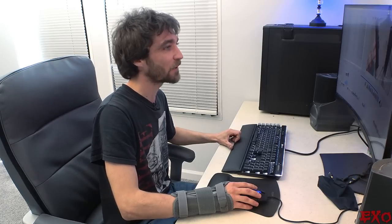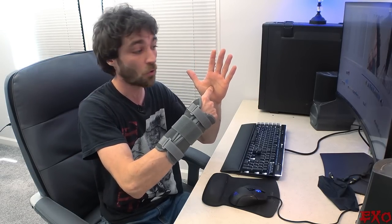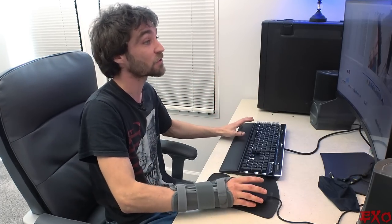I want big time accuracy when mounting these bad boys. My port width depends on it, so there's no pulling any punches. Made sure to use the existing frame line of the steel cage to extend out as a guide marker. This is exactly where I need to be. So I do this little trick to avoid things dancing around on me. Small little screws to keep the centers aligned. That's the biggest bugger. If you're not directly centered in the hole, it will pull in that direction, but with small little guys first, it's so easy to find that center, plus it acts kind of like a guide for the big fellas to ride down straight. Pretty handy.